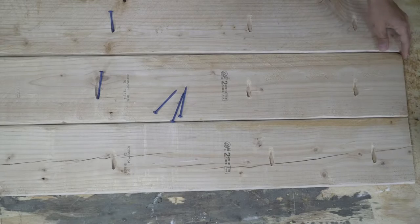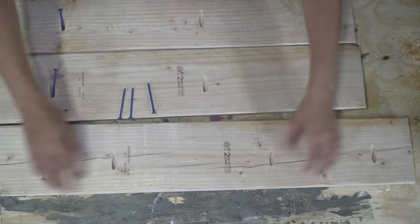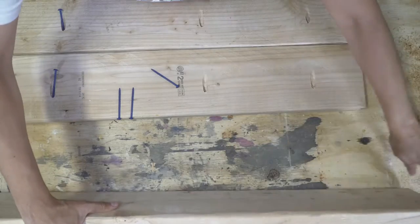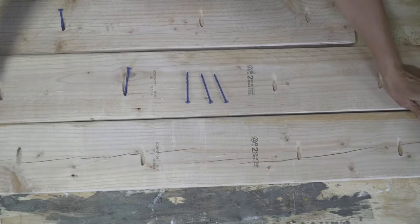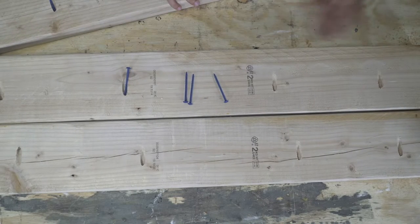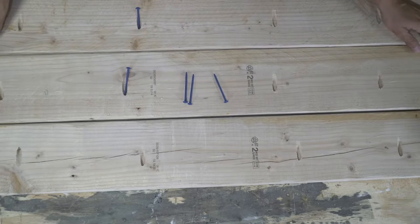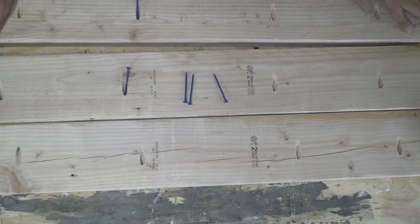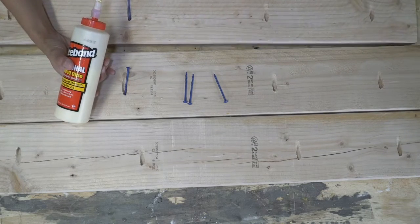And you can see that the wood isn't always very straight. If you have a planer, that's great. I do not. For outdoor projects, I always like a natural look, not obvious bad workmanship crookedness, but kind of natural wood. It comes from the wood crookedness. Let me get this where you guys can see. What I've been doing is clearing off the little wood chips, because sometimes that causes things not to sit perfectly even, and that's why you get the rocking. So that's looking pretty good there. What I'm going to do is use a little bit of glue between the two pieces, and we'll start rocking them together. I'm going to clamp them together.